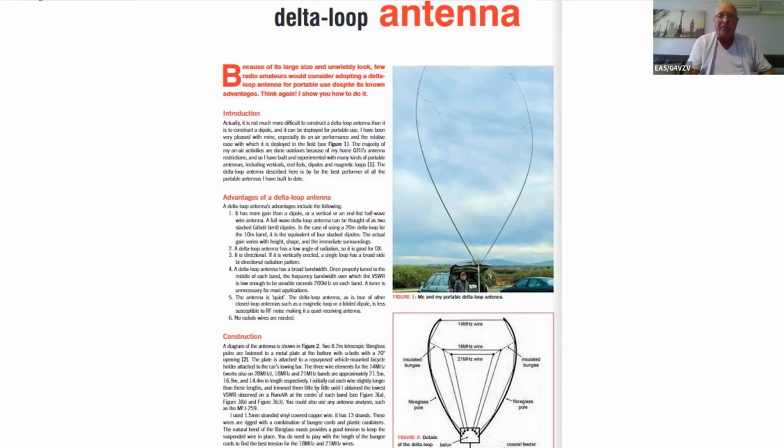The antenna that I've had up recently is a delta loop, slightly smaller, by Mike 0 Papa Lima Kilo. And he used a vertical feed line that came from the top horizontal wire. A fantastic antenna, but I do believe that the full-sized, as you've got like a monoband version, is better. You get a good 5 S-points null off the side of that antenna. So in England, if you're pointing northeast, southwest, you'll null the Italians out almost down to 0.